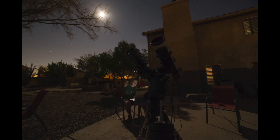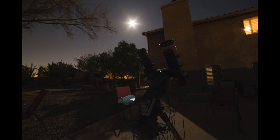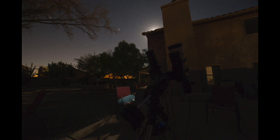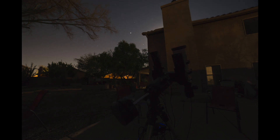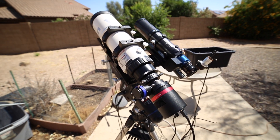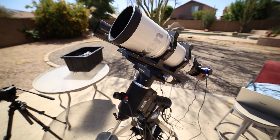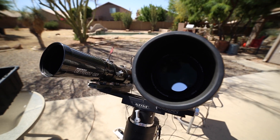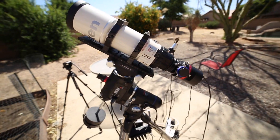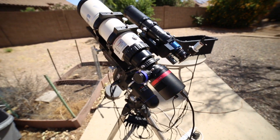While this time-lapse rolls, I thought I'd explain why the images coming off the back of the camera look black and white instead of color, even though I'm using a color camera. The thing with all color cameras is they have a CFA — a Color Filter Array — in front of them. Typically it's an arrangement of red, green, green, and blue pixels stacked next to each other. The camera is dumb and doesn't know which filter is which, so in software you have to tell it. My capture software doesn't assign colors during capture, so it looks black and white — it's just reading what each individual pixel sees, and I tell it what color to be later on.